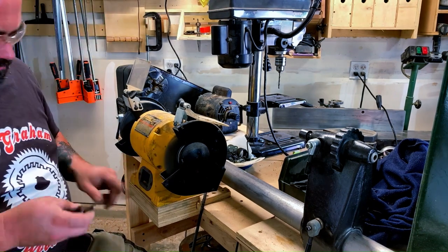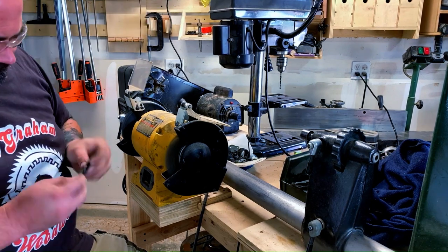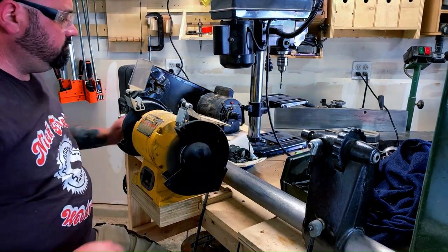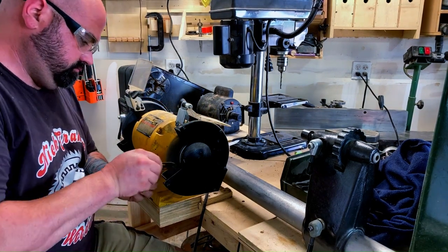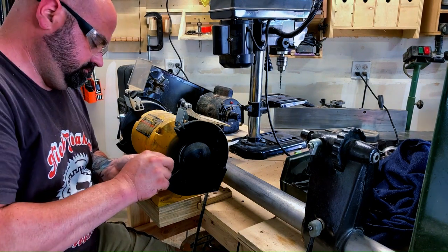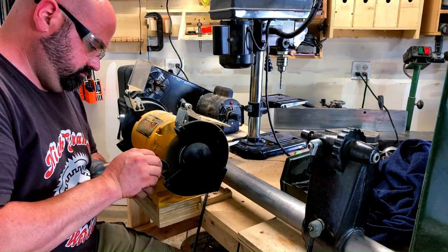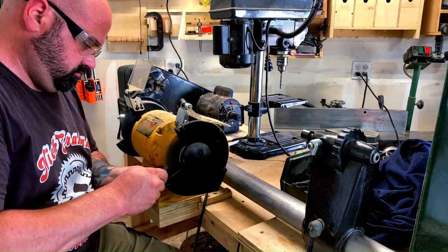The hinges were copper plated. I have a magnet on top of my drill press to hold the chuck key. I tapped them on there, and sure enough, they're magnetic. I opted to nickel plate these since some items were already nickel plated, and try to keep everything uniform, even though it's not the factory look.